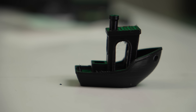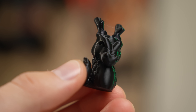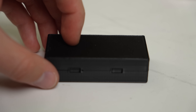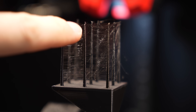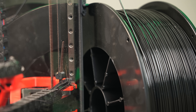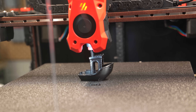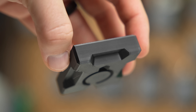The only other thing to discuss was a bit of stringing. With this being a copolyester or high-temperature PETG as they call it, I can't say I'm super surprised — PETG is generally one of the stringier filaments I've worked with. The stringing from Polyhex was very fine, and most prints had only a few small strands that were really easy to clean up. The stringing was worst on the Autodesk FDM test, which involves very intense retractions, and was also the last print I ran after having the spool open for a few days. I'm confident that with an active dryer and further retraction tuning, I could have reduced the stringing. Print-wise, other than higher temperatures and needing an enclosure, this filament prints almost exactly like a standard PETG. If you have a good PETG profile, the transition to Polyhex won't be that difficult. Although I wouldn't consider this a beginner filament, it has been much easier to print with than the standard polycarbonate I attempted many years ago.